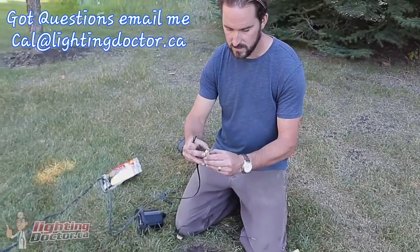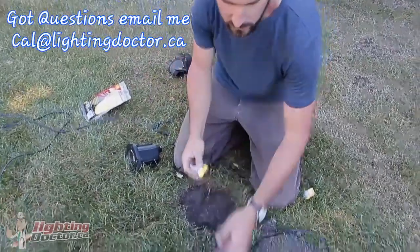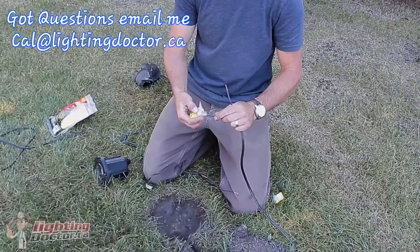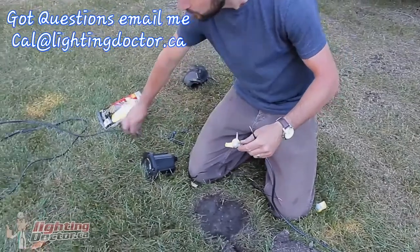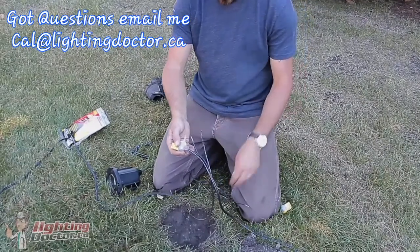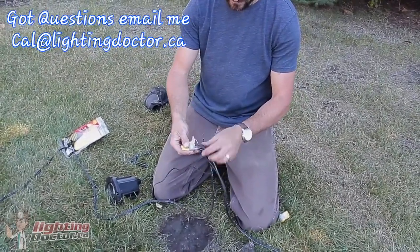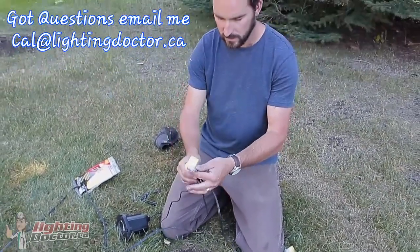So what you do is they just open up. There's a couple ports on the bottom. You've got your wire coming in, goes into one, push it right to the end. You've got your wire going out, goes into the other port, and then you've got your fixture wire, goes into the last port. And then you snap that tight, and you can see those wires aren't coming loose.